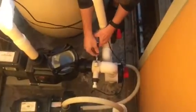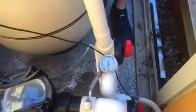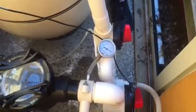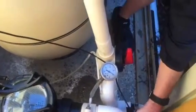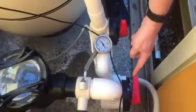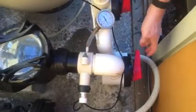It wasn't getting enough negative pressure through here so the chemical wasn't flowing and the pool was having struggles. So all you do is pull that off, put that one on. Sitting at zero now — we'll run it. That's a minimum of 20 of course. So that's pretty spot on. Because this is good 50mm plumbing in the front, there's good flow and not a lot of negative pressure, so we actually had to make the pump work a bit harder to get better suction through there.